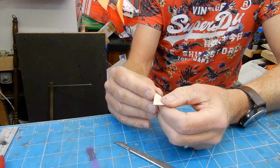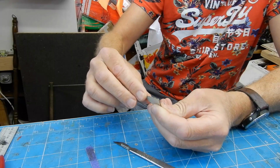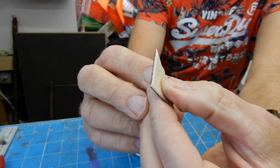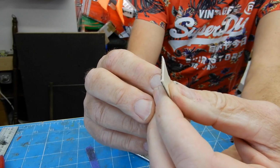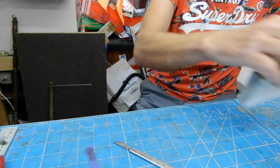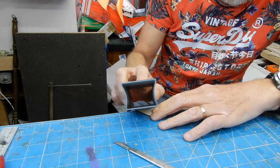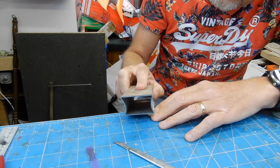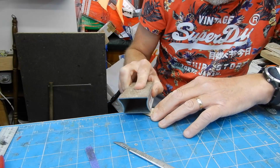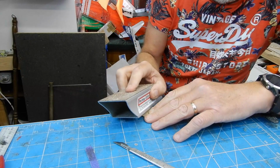Right, these triangular pieces, it says in the instructions obviously just to chamfer the edge so it's a lot more aerodynamic. So you can see there where I've actually sanded it, and I've just started to get, I think it's 3 layers of ply there, and I've got that line through there which tells me that I've gone down straight enough. Now all I did was I literally held them on the end of the bench like so, and then I got my plane. I just found it easier to do it like this, and then just slowly work your way round the triangle.